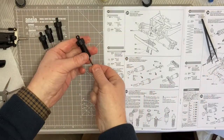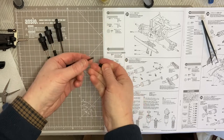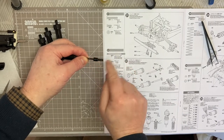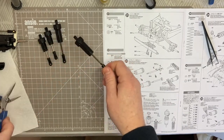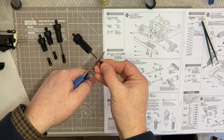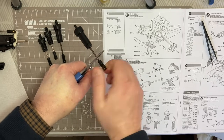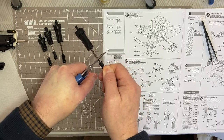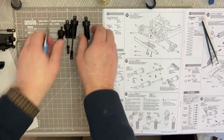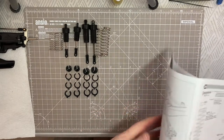Filled up these with oil, put the caps on, and tightened them down. They all have a nicely smooth action. The last bit - slightly different to the drawing again - I then pop the ends on. These ends have already been threaded for you. I use a pair of non-serrated electronic pliers to grip this directly and tighten it on nice and firmly until it's tight and not going anywhere. All four are now done.